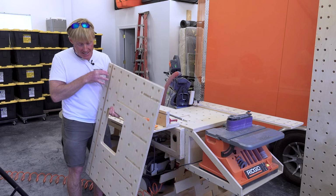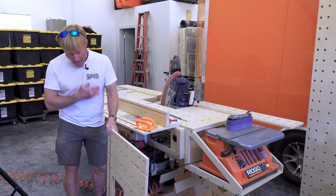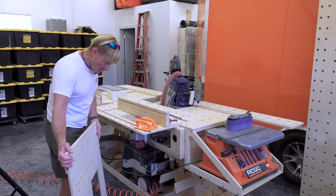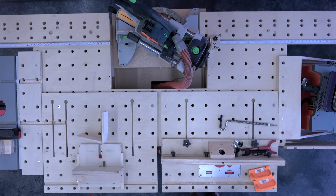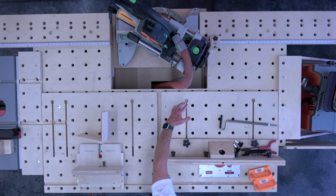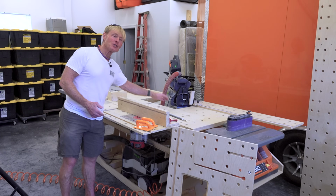And so it ended up being this, and the beauty of this router table is it's one piece of 18mm plywood. There are no add-ons to it. There are no stiffeners, strongbacks. There's nothing to make it thicker. There's no hardware. It is simply a piece of 18mm ply with wood cut away from it. It's sort of like the router table is in there, but I had to find it. So the router table went on, and just a couple of bench dogs to hold it down. As I looked at the router table on the total station, it added real estate. So it not only was a router table, but without the fence, it's also extra work surface. And that led to the Smart Station.